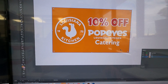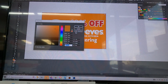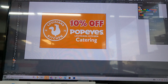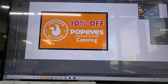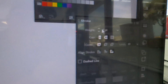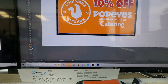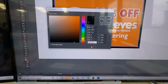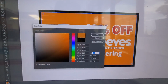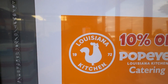We're going to go back to the print layer here, click on our background, and add a little bit of a bleed to this. I'm going to copy the fill color from down here, and now we're going to put on a 7-point stroke and set it to the outside. Oops. Set it to the outside there, 7-point stroke. That is where your stroke options are. Then we go into the stroke color and paste in that background color that we copied. It should look something like that, and if we click off of it, you can see that cut layer is sitting nicely on top.